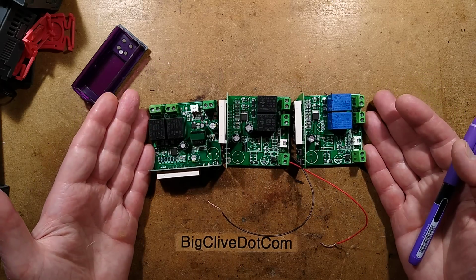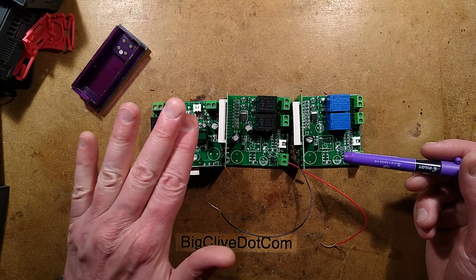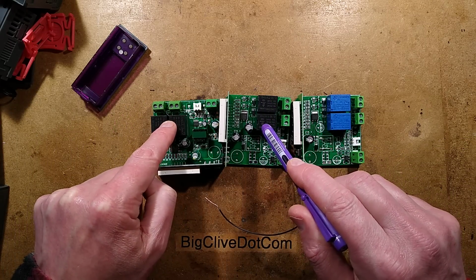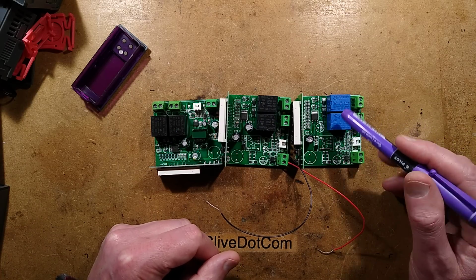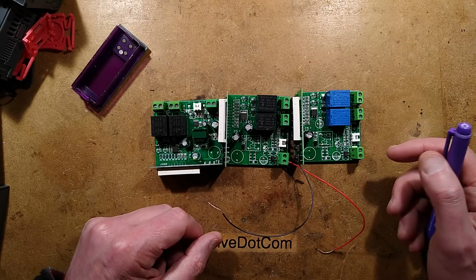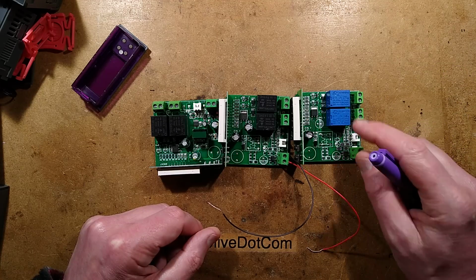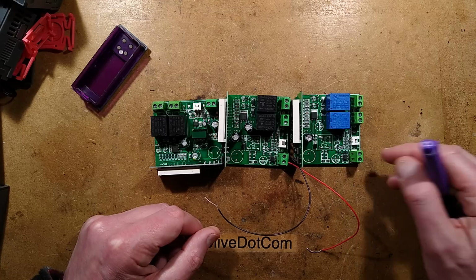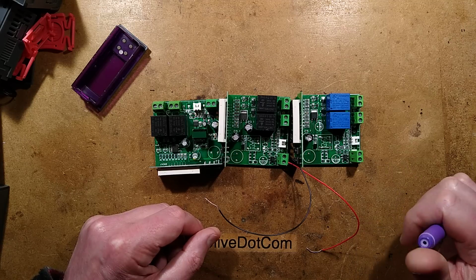I mean, you're getting a lot for your money. But as I say, I'd recommend against the mains voltage one, and I'd recommend against switching high loads through these relays. I'd recommend, if you've got a serious application, 12 volt, and using these relays to then switch the coil of a beefier, chunkier relay, and that means all the wear is moved to the outer relay, and it means that it's a cheaper, easier fix. Although having said that, these are about £10 each, so it's not that dramatic. It also avoids any awkwardness of these things burning up inside, as can sometimes happen.